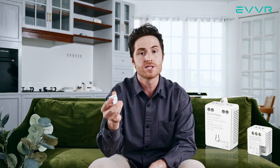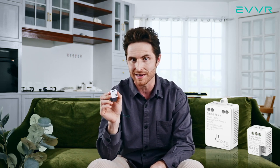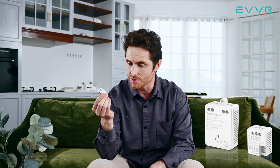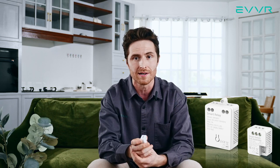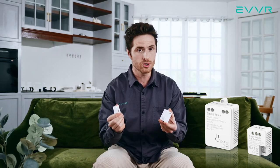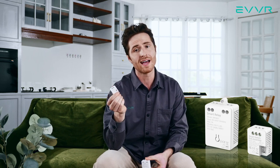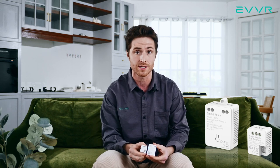For the smart switch sub-assembly, this installs near the mechanical switch for the light itself. It's incredibly small, incredibly compact, and needs no neutral wire for installation. Two of these can fit in almost any electrical box, which means this supports up to four gang wall switches. Although this is a two-part product, you don't necessarily have to install the smart switch sub-assembly if you don't plan on using the mechanical light switch to control your lights.